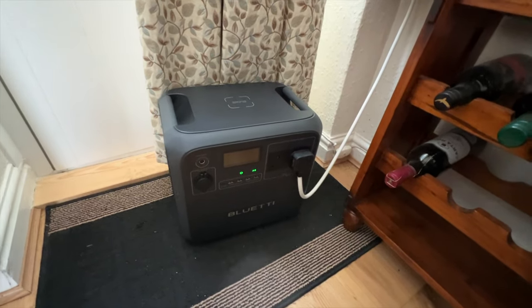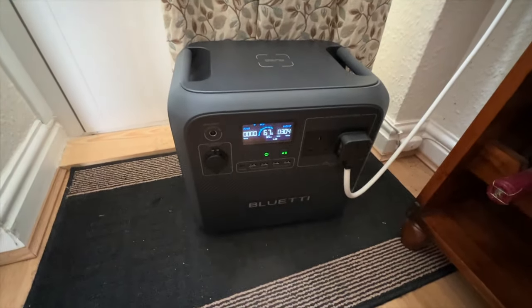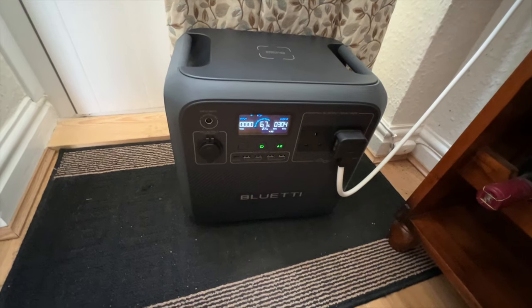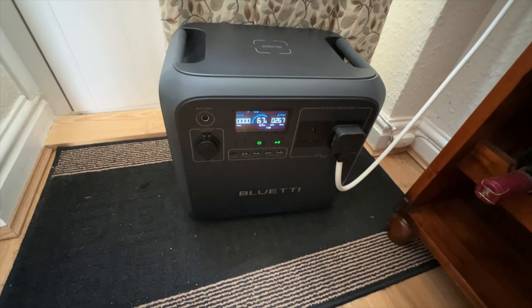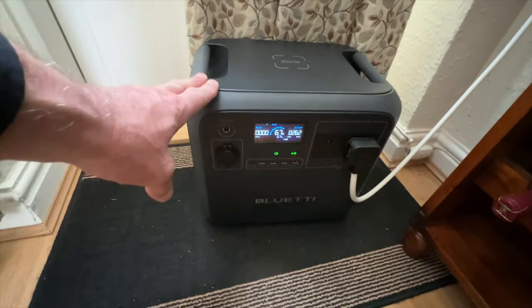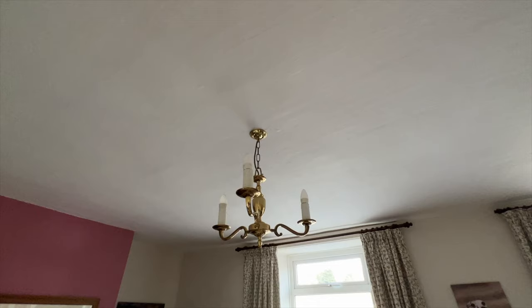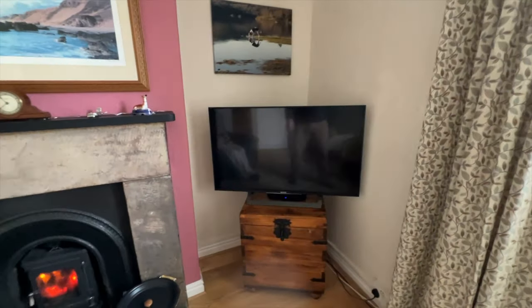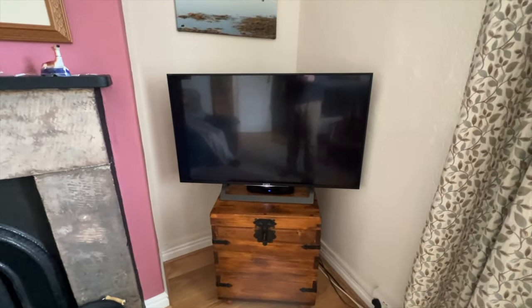It's there on the floor plugged into the switch-over unit. I'll switch the power off and switch it over to the generator — and now everything in the cottage is linked to that generator. It's currently drawing over 300 watts: the central heating boiler is on and maybe a fridge or something, and that'll go up and down. But it proves that this is a quality unit and the inverter is good quality — otherwise the fuses in the fuse box would have switched off.